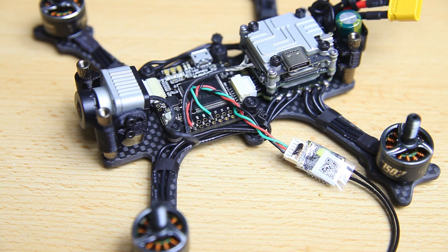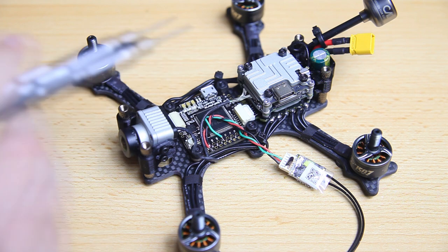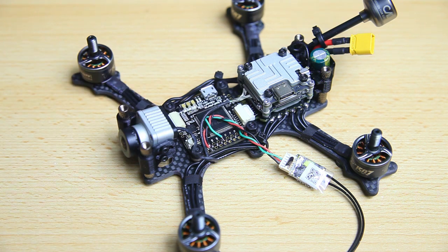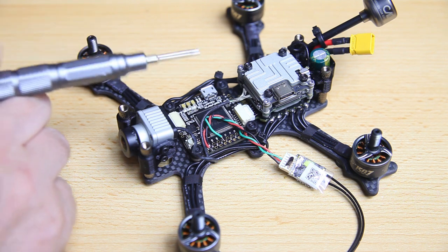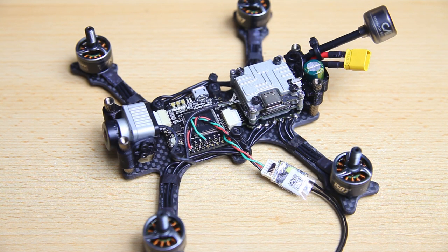And that's everything. So the hardware installation is pretty simple, and the Betaflight configuration is pretty simple as well, which is nice. So, for me, this has answered two questions basically. Is it hard to install a secondary receiver in a digital setup like this? I think the answer is no. Physically, it's easy, and the Betaflight configuration is pretty easy as well. The old, if you will, receiver in that Caddx Air Unit isn't in the way. It doesn't really matter basically.